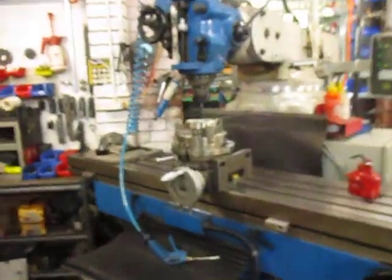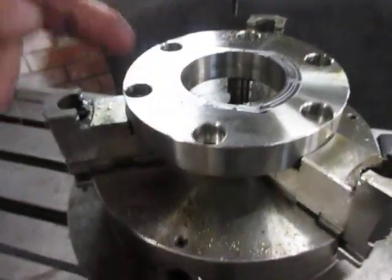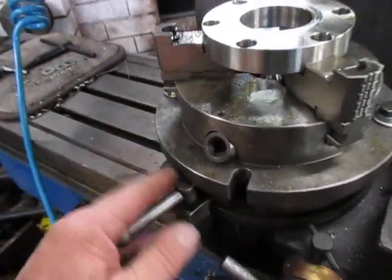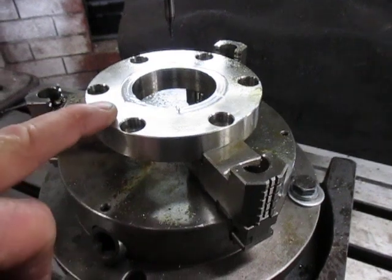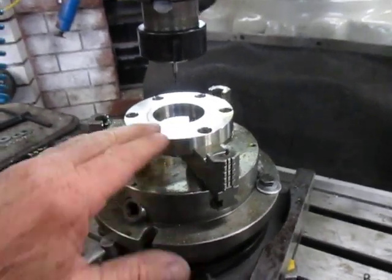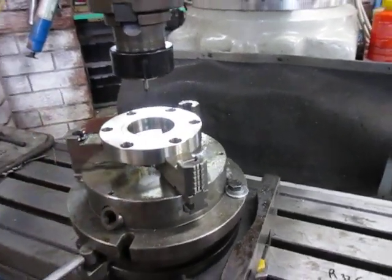So I've got it up on the mill now, as the previous little movie showed. We've got it laid out so that we've got the two straight pieces here in the right orientation, relative to the holes and the two round pieces. We're doing the X, Y and then rotating the table. I may decide to leave this and get it wire cut — I wanted to make sure I have the orientation correct. I didn't mark it out with any blue or anything. I just worked with a 3mm cutter, took one and a half mil off the radiuses that I needed and worked accordingly.